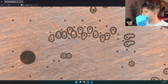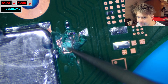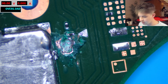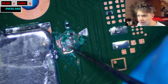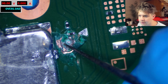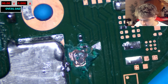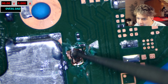Here's the dat zero point. Going one layer deeper — I think what we're seeing is solder sticking to this via, connected to the pad here. Normally I would use some flux to catch residue, and once we start grinding through some of these copper layers I'll use a little bit of flux just to catch any debris. So you can see we're all the way through the customer's solder mask down there. Fortunately they didn't go further than the third layer. Right below this substrate here is the third layer where they should have stopped to solder to the dat zero point.